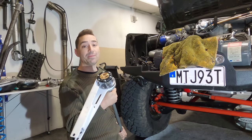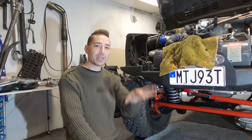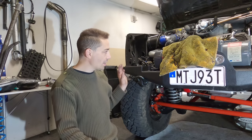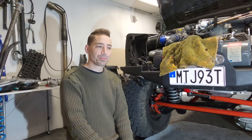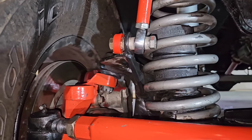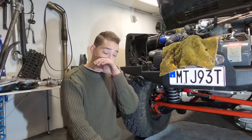You're probably thinking wow, that looks really strong — it'll never bend. It probably won't. But as we've gathered as we get older in life, you start to see the code coming down the screen like in the Matrix, and you realise it's just one big ring-around-the-rosy. You're never really fixing problems like this — you're just moving them around. So the problem now will be moved elsewhere. Either the hub will break or the links on the axle will break. Because if you look at them, they're not being supported on either side, and the bolt is too long so the leverage will bend that piece of metal. That piece of metal has to be supported from either end of the bolt, like I've built here — or you go back to the drawing board, or it's made from really thick metal. We'll be here again, don't you worry.